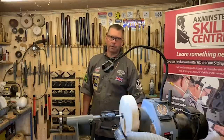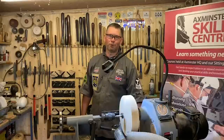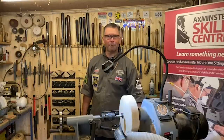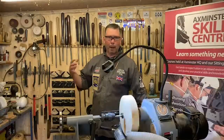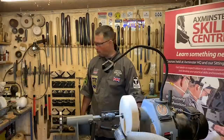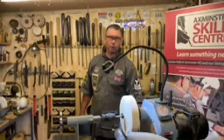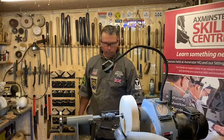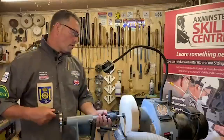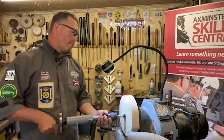It's basic chemistry, isn't it? You know what a heap of horse manure does if it's left long enough. You can see the steam and smoke coming away from it. It's the same sort of thing. So a big bundle of rags together will sometimes cause a problem. So don't do it. Leave them out to dry. Don't bundle them together. I'm just going to make a shallow hole, just to the depth of the drill bit.